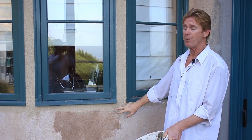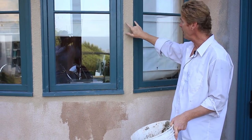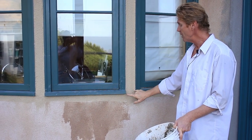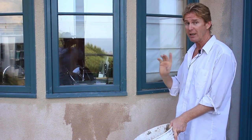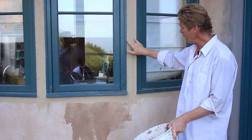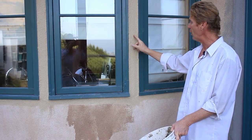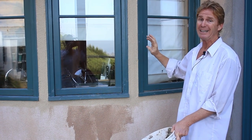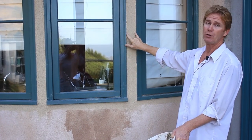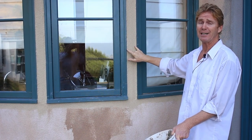This is a pretty good example because you can see it even with the camera. It's about 10 tints off, but usually you can't hardly see it unless it rains. Why do people do this? Because you've got some of the trim paint on the stucco, or like on a job we just did, half the job leaked, so they used the paint to bridge all the stucco and seal it.